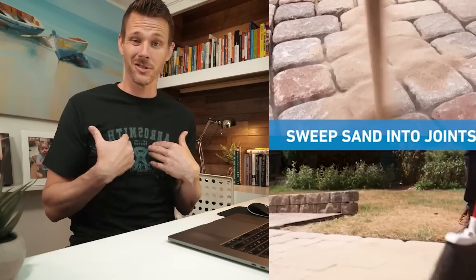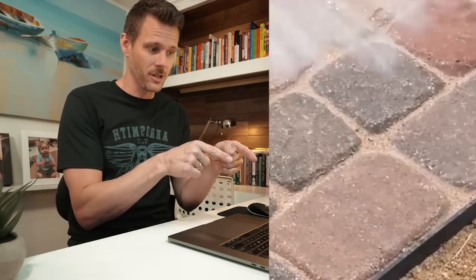They are cutting and putting polymeric sand in between to lock it in, with edging on the outside. I also don't like that black plastic edging simply because it flexes and moves with hot-cold expansion and contraction — I prefer mortar along the outside, which seems to be a long-lasting product. I want to thank Lowe's for sponsoring this part of the video — nope, totally kidding — but they put together an amazing little template. My tweaks: clean rock, no sand, and replace the plastic edging with mortar. A lot of these things you might have around the house, and you're just putting in your sweat equity.